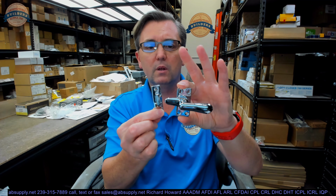Think your installation through. Be absolutely positive that you're ordering the right strike. It happens often enough that people don't get the strike that they end up needing because they just weren't sure when they ordered it or thought they were sure. And it's so often that the manufacturers sell strikes separately. But you can use this on anything, cabinets, doors, anywhere where you're going to do basically a surface mount in both areas.